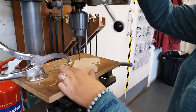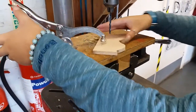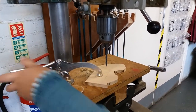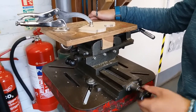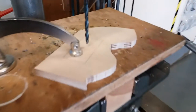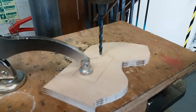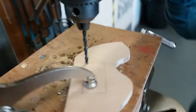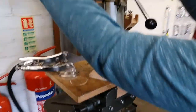I'm going to drill in all four of the corners here and so on. First of all I'm just going to adjust the clamp and clamp it in. Now I need to change my position and rotate it. We don't want the drill to actually touch those lines - we want it to be slightly in between. You need to make sure that the guard is down. Never operate your drill without the guard down. Then turn it on and drill right the way through.